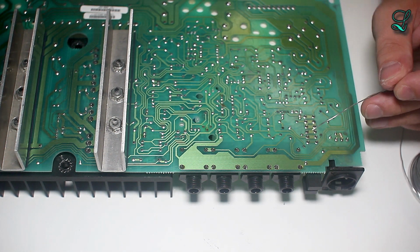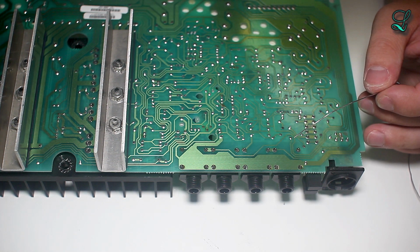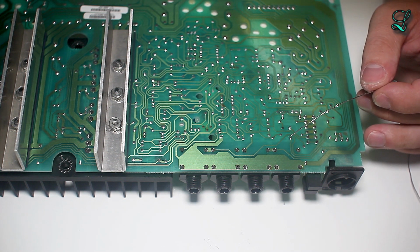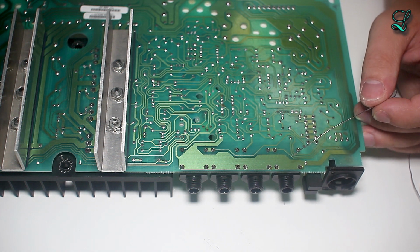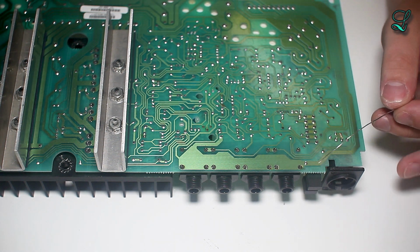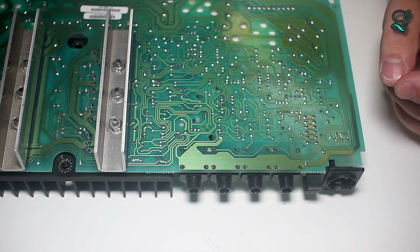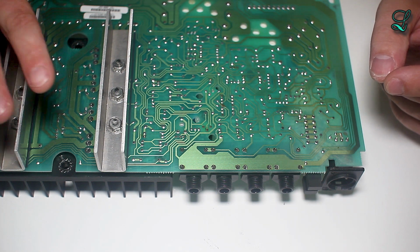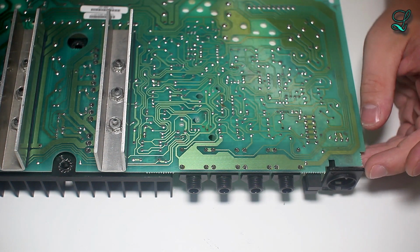I'm going to do a little visual inspection, make sure everything else is good. You can tell this was wave soldered, which they actually passed the board over a molten pool of solder. It's actually pretty terrifying to see that. So it's exactly what you think, wave soldering. There's a wave of molten solder in this big tub that goes under the board.